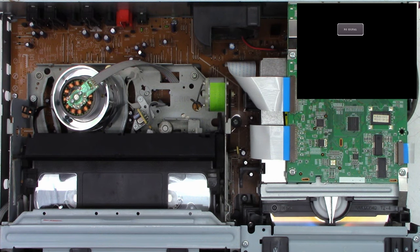Okay, well, I certainly like that a lot better. I'm going to have to blow off some of the crud. Some crud got into the brush. Hard to see, but yeah, it's got crud built up in it. So next, acetone and a cotton swab will wipe this out. Acetone will not eat the plastic on this type of switch, so that is a very good thing.